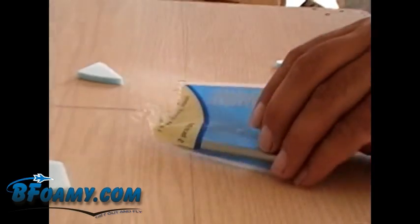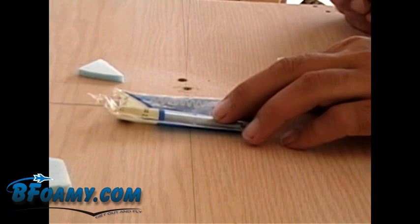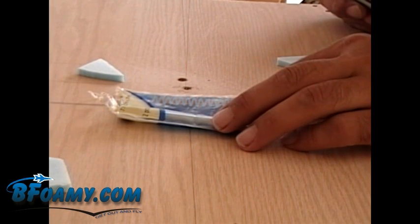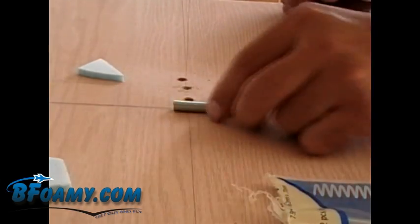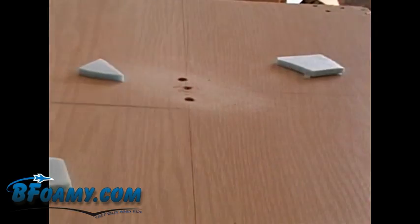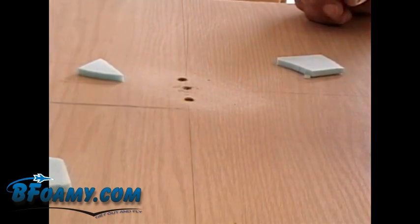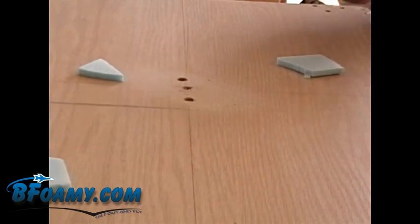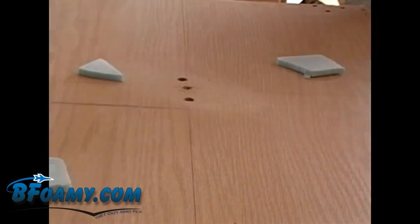I took a box of these springs — the bag comes with two springs. They're 7.94 mm by 76.2 mm by 0.7 mm. I cut one of them off and made it shorter, because you don't need the full length — it's a pretty long one. I used 6-32 bolts, one in the top and one in the bottom to hold a bracket. Only used two of them — 98 cents at Lowe's.